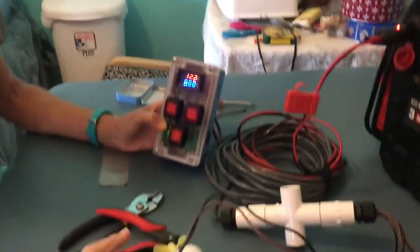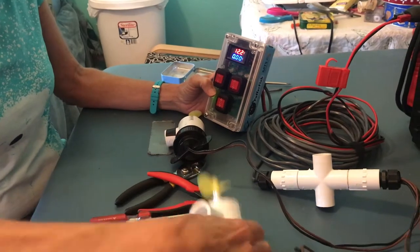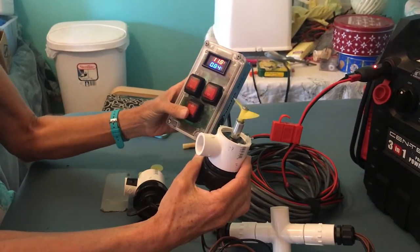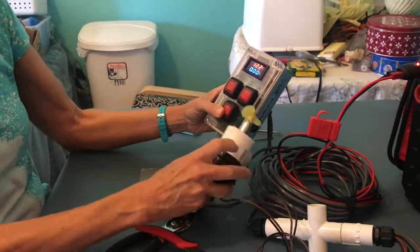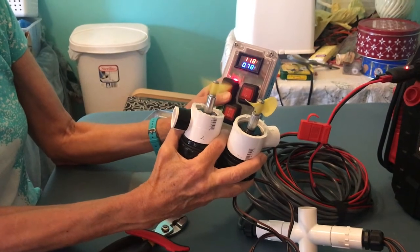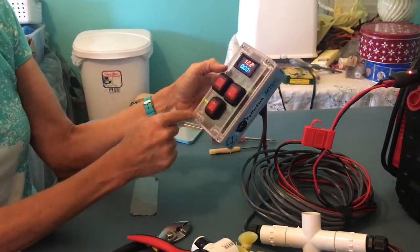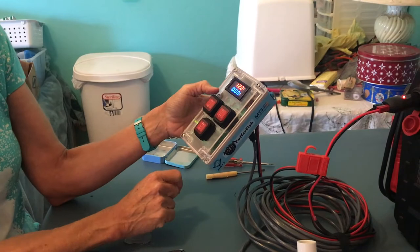I've got my volts in here. What I want to do next is test the motors and see which motor is which. This one says up/down, so I'm going to believe it's up/down and see if it goes green/red — this one is good. I'll try both, holding them up in the air: this one going one direction, the other direction. So I know this is a good board, my voltmeter is working, my ammeter is working. I'm going to mark it as good and hold on to it.